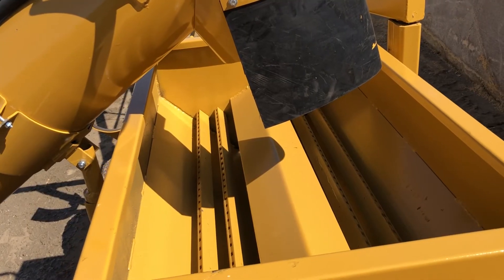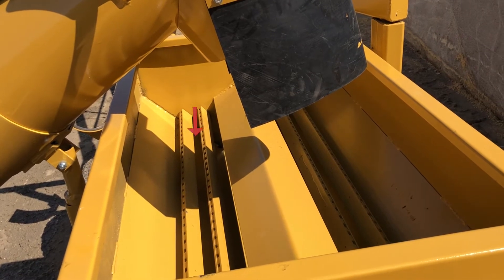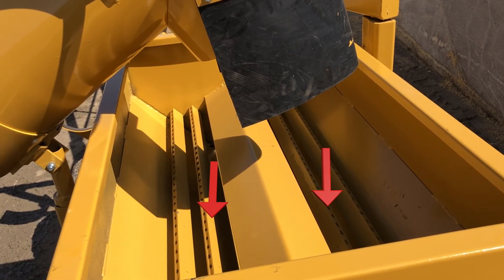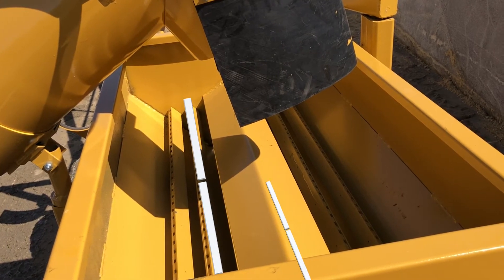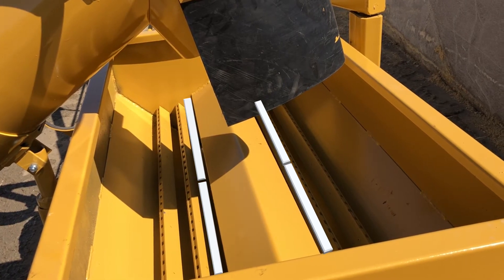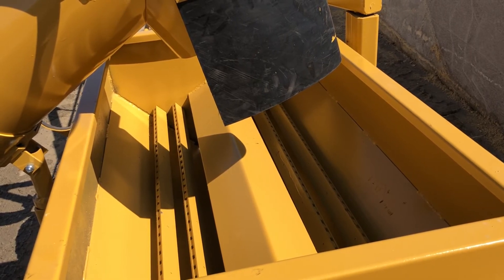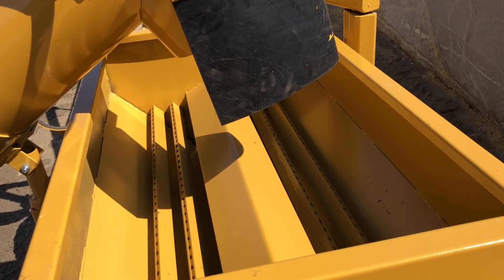In all of the Hanke roller mills produced, in our hoppers, there are magnets to catch unwanted metal and materials coming through the roller mill before it gets to the rolls themselves. You'll also notice in the center of the hopper a deflector plate designed to deflect the corn over the width of the rolls. Below the deflector plate is an adjustment gate which controls the rate of flow of grain out of the hopper directly to the crush point of the rolls.